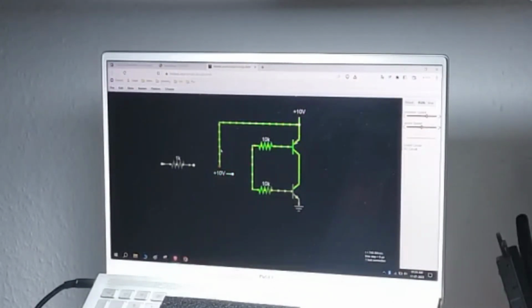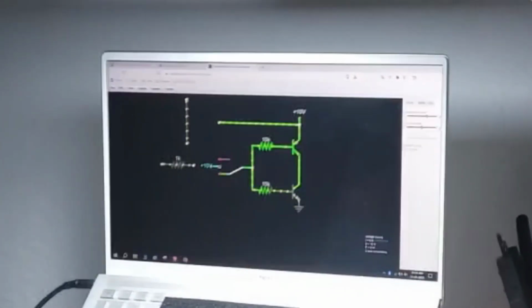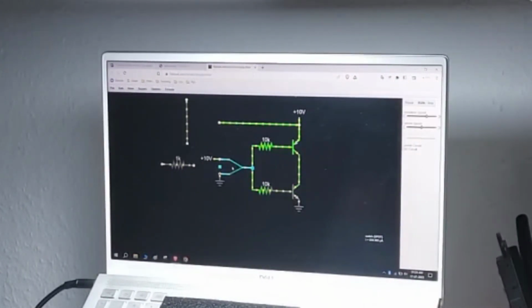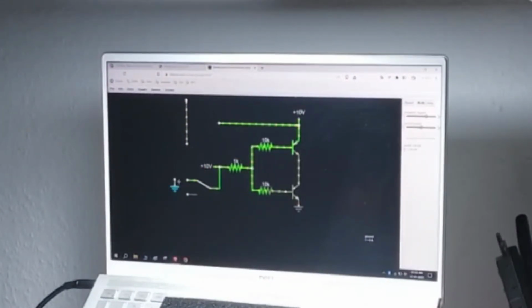So if we had a push-pull output, an SPDT switch that switches between 10 volts and ground. A complementary output has the same effect as having a pull-up. So the pull-up theoretically doesn't matter. But it's required, because if you literally have nothing connected on the input, you blow it. It's for contingency reasons. It's for cope, because your circuit is not well designed. It's the TL494, it's the best circuit they ever designed.